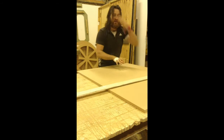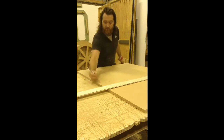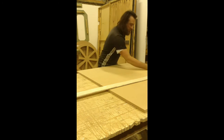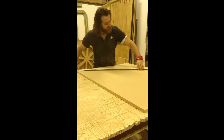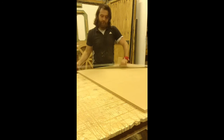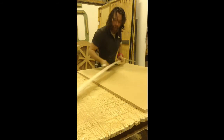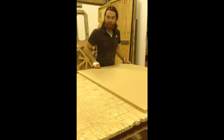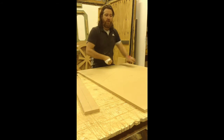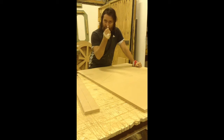To find the centre of any piece of board or material, you use the four corners. You've got one, two, three, four corners. You line your straight edge up with opposite corners — just like that, and just like that. As a result, you have found your centre. Now, to start to cut the circle, you need your standard router cutter — no bearings, nothing. Just make sure it is sharp. The key to good circles are sharp router bits.